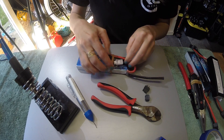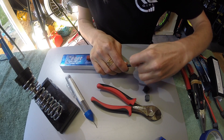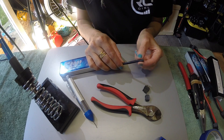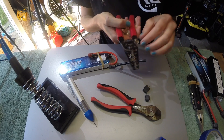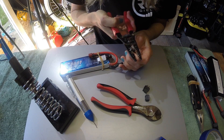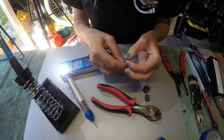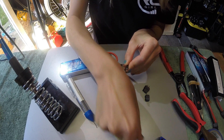Get the balance port out of the way as well. Remove the old heat shrink, then strip a little bit of the casing off — about half a centimeter. This is pretty high gauge wire, so use the largest setting on your wire strippers. You don't want to go all the way to the cable; you just want to cut the plastic off. Make sure all the wires aren't deformed from when you snipped it, that all the wires are together. If there are any stragglers, remove those.